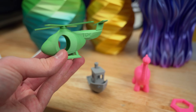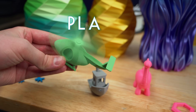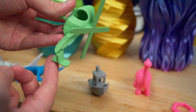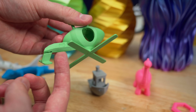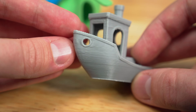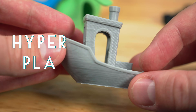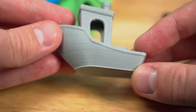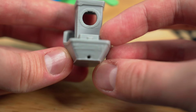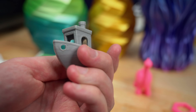Here's a bunch of different tests and prints across different materials. A PLA helicopter with spinning in-place blades printed great and showed good bridging on the tail. Here's the 16-minute benchy — it turned out all right. It does have some artifacting, as expected with speed benchies, but a lot of detail came through with clean lines, good overhangs, and good dimensional accuracy.